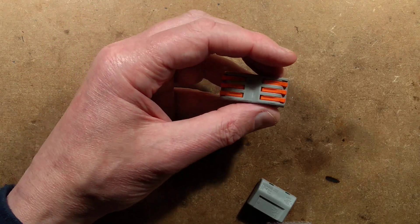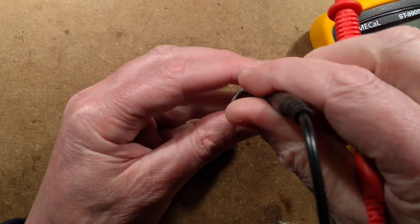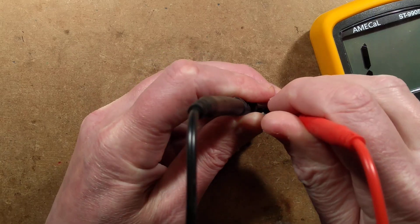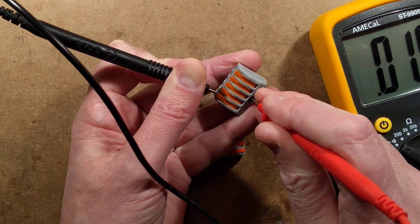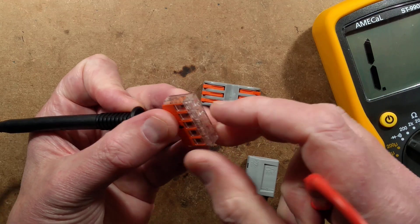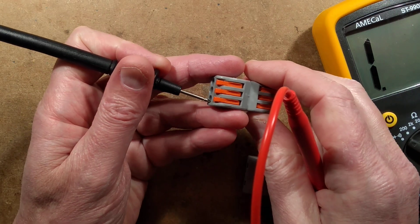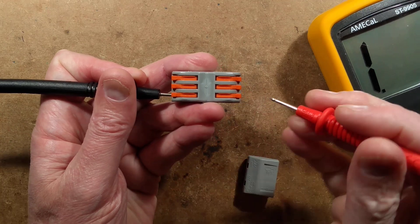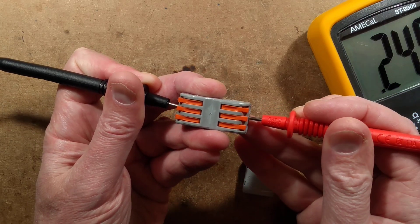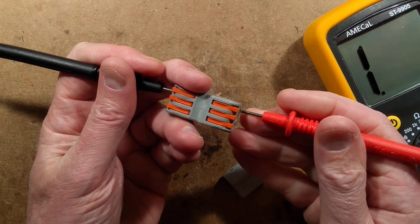Unlike the commoning ones, let's poke my probes in and prove whether they're all common from one end to the other. The original WAGO also has a little terminal where you can poke a probe to test - this one notably doesn't, though the low-profile one does have that at the back. However, this one does not common all the wires together - it just loops through from terminal 1 to terminal 1, not connected to the others. Terminal 2 goes to terminal 2, and terminal 3 goes to terminal 3.